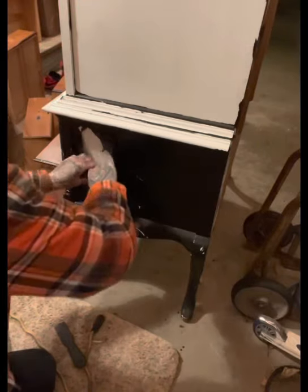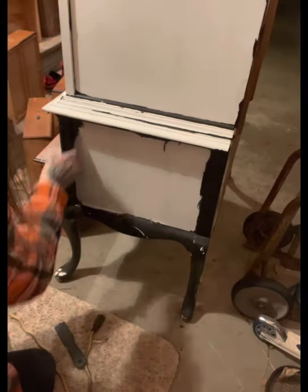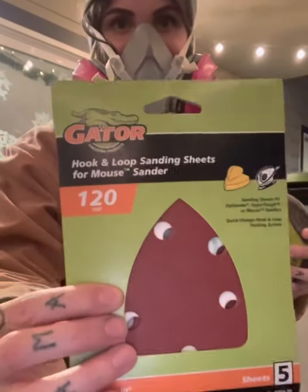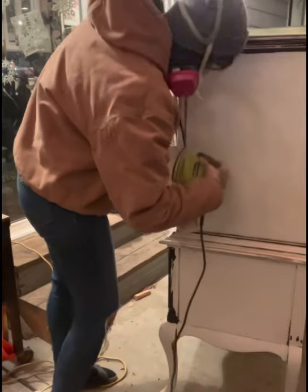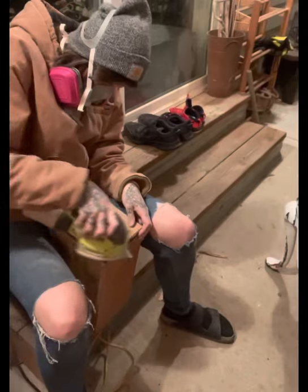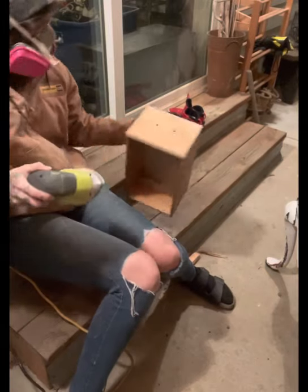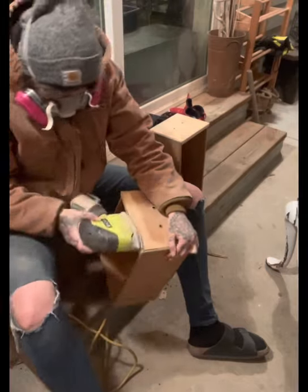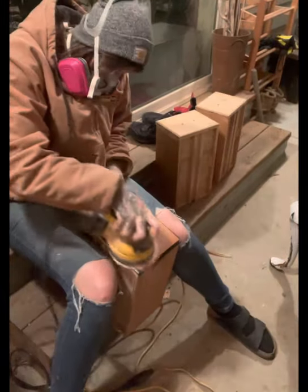It was pretty time consuming. Once I got all of the black tar off, I tried to sand it with a 120 grit and it was fruitless. I tried sanding a little bit and then I was like, this isn't working — I'm going to need to completely strip this. It did work for the drawers because the drawers didn't have the white paint under the black, so I just pulled off the black paint and sanded down all the drawers.